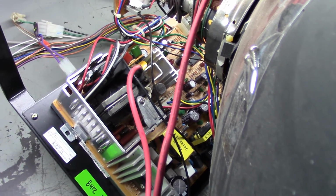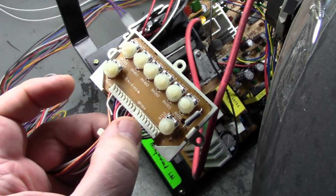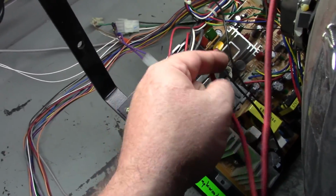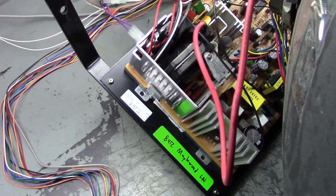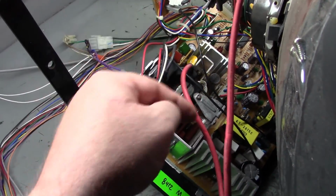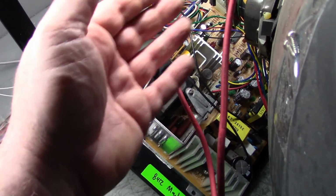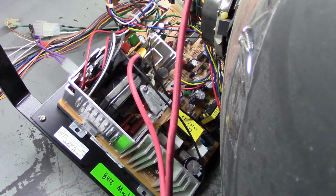The easiest way to do this is to look at your vertical size pot and follow the trace to which wire it goes to, and follow it to where it hooks up to the main chassis, because that's going to be your vertical circuit. The vertical size is going to determine your vertical circuit on the chassis. So we can follow where it goes to the board and follow that trace to determine the IC or a resistor or something on the circuit that's open. And we'll see if we can figure it out. So here we go.